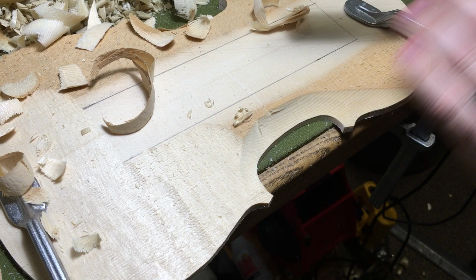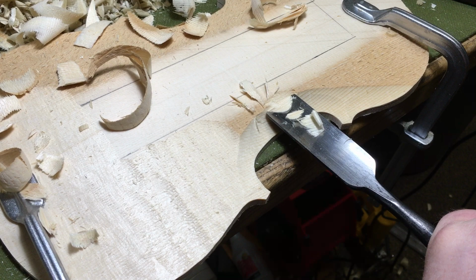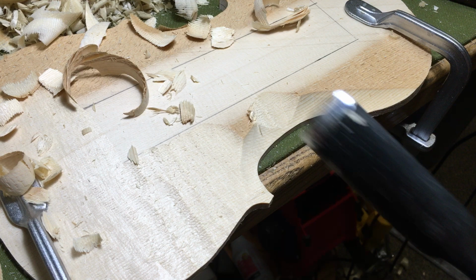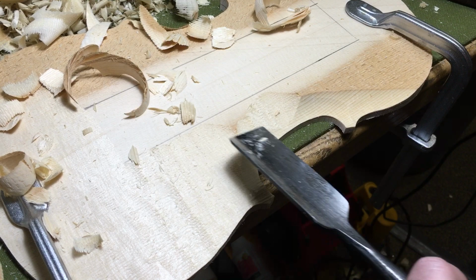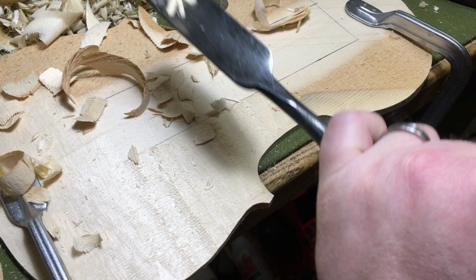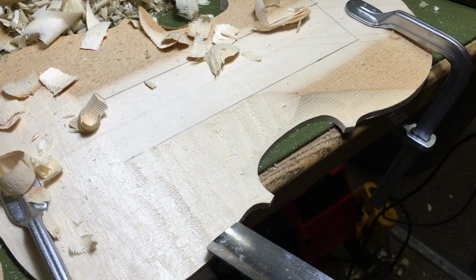So that brings all of this down to the edge thickness that I have marked. And then of course, since this is so much narrower here, this is a lot steeper angle. So here we're looking at about that degree. You can see the difference in the angle as I extend that. I'm doing a much steeper angle up. And the reason I'm going cross grain right here, going just perpendicular to the grain, is to keep from having big tear outs in either direction. Okay.